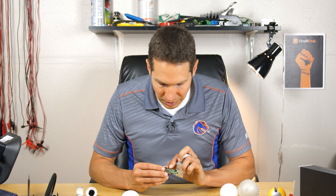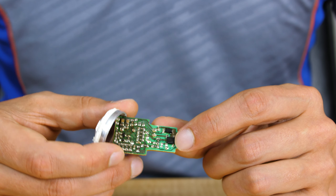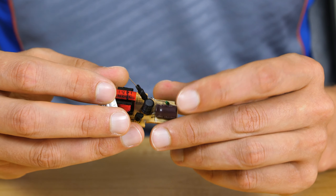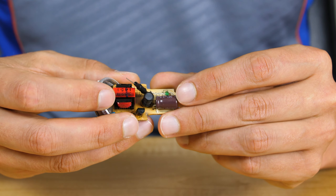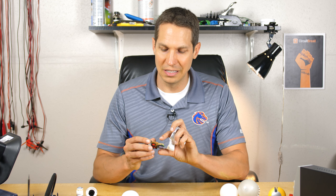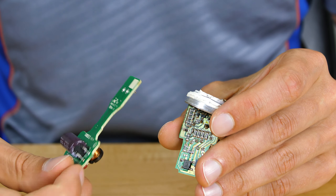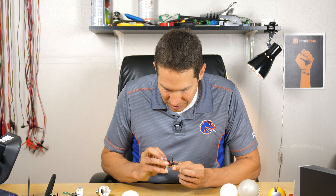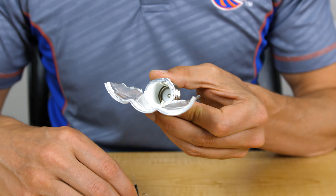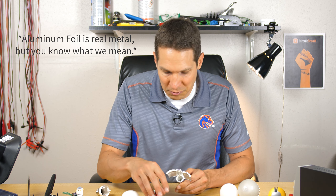Look at how they jammed the components on there — tons of little resistors, two tiny capacitors, an ABS10 which I looked up and is definitely a rectifier, and a diode. On the backside, there's another big electrolytic capacitor to smooth the incoming power, plus a BJT transistor and a transformer. It's very interesting to see these electronics, so much smaller than the Cree's, with almost no free space on the board. Even the free space is documented, showing how everything should fit together. It's technically metal, but it's almost closer to aluminum foil than real metal — just a lot of plastic in its construction.